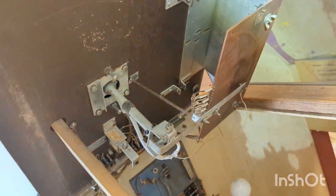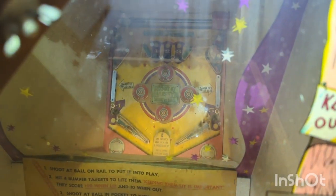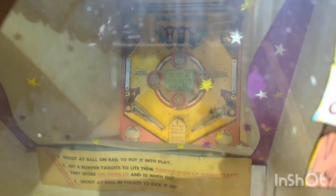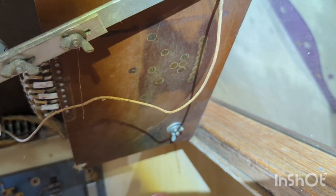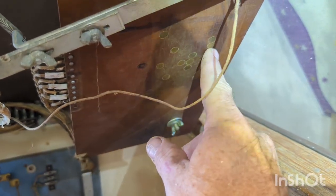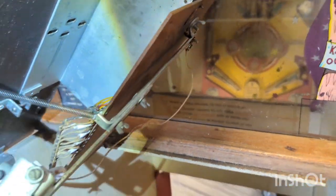I'm moving the gun with this end here. Draw this little pencil out. Basically, the clever part about this is you're shooting in there, and you can see those targets and everything. Really, the clever design feature is the game only needs to know when you're hitting a target, designated by all these little electrodes here. Everything else is just a missed shot - figure that out just by pulling the trigger. If you pull the trigger and you didn't hit one of these, it's a bad shot. Each one of these points represents one of those targets down there. It's got a little electrode there, a wire going through there. If it closes the switch between that point and one of these electrodes, it knows you hit, say, one of the pop bumpers. That's how it works - it's pretty slick.